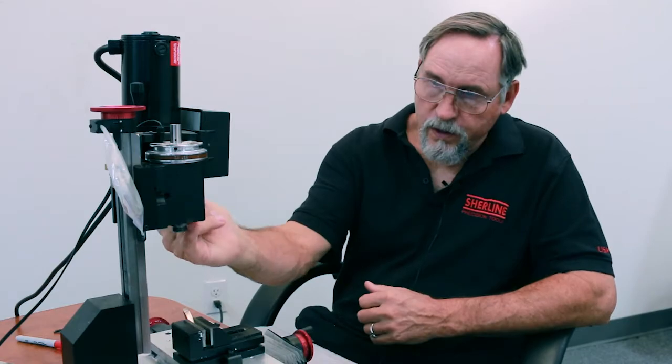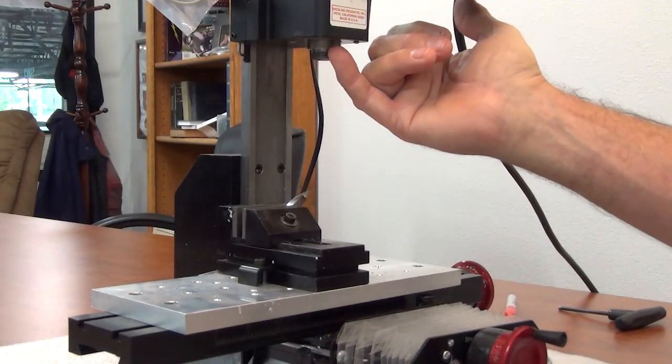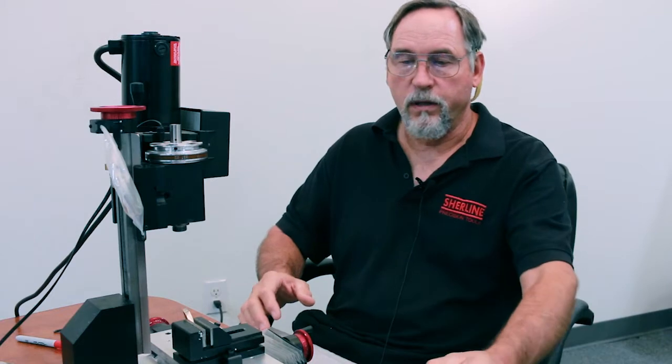The video that we're going to do right now is going to show you how to true up the shoulder on your spindle in order to get your end mill holders, chucks, and other accessories that thread on to run as true as possible. Okay. So what I'd like to start by saying is on our mill, I'm showing it on the mill first because truing it up on the mill is a lot harder. On the lathe, it's real easy. It's just a facing operation.